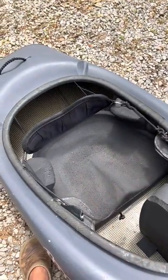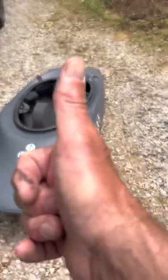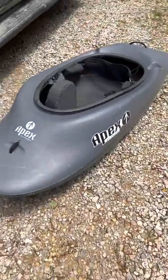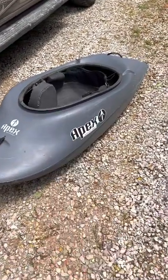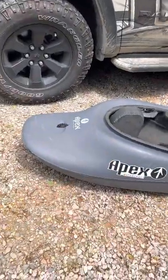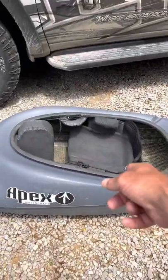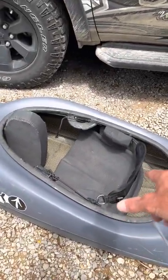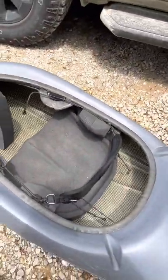I haven't figured out a water-free backband solution yet. The design parameters are: performance, lightweight, good looking, and durable. You will likely need to do a little trim work on the foot block unless you happen to be short-legged. You'll need to decide how many hip pad shims you need, and what seat size fits you. With a skinny-butt seat the edges come in about an inch, giving you a beautiful contour that houses you really well with no side-to-side movement, even without hip pads.